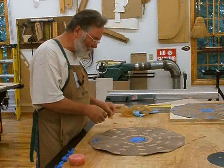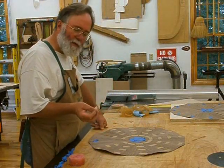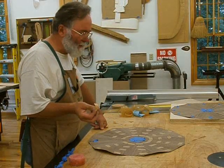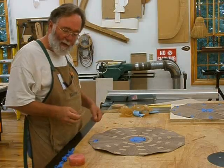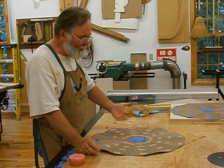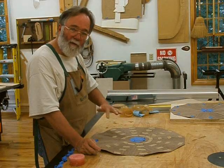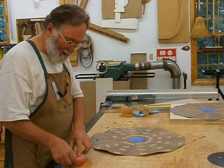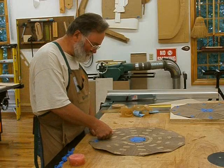Okay, so you slowly tape the wedges together. I'm using veneer tape that's not perforated. It's a little bit thicker stuff, because it gives me a lot of strength, and I'm going to be using an iron-on, heat-lock glue that I'll place on the bottom and be ironing on the top. Later on, when everything's set, I can take the tape off and it doesn't get in the way of the joint. I'm using about 4 cross pieces per wedge.